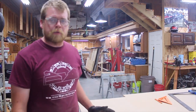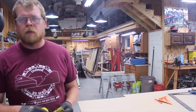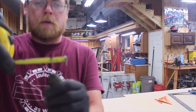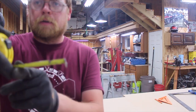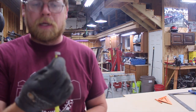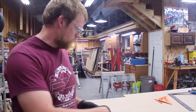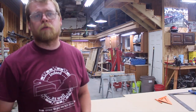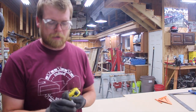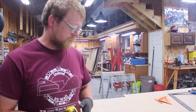Hey, one thing I'm going to do is I'm going to put a slot down the middle and down each axle centerline. I'm going to make that slot the width of a blade, and then I'll have to put a little spacer behind one tape measure, and I'll pick just a tape measure that I'll mark somehow. I might just bend the tip, but make it to where from either side that line will be dead center on the board, and so when I hook in and measure out from either side, it'll be exactly right as long as I go for the back of this. The push direction won't work because the spacers would have to be too wide, but I'll calibrate it and make sure it's right based on the other edge of the table.